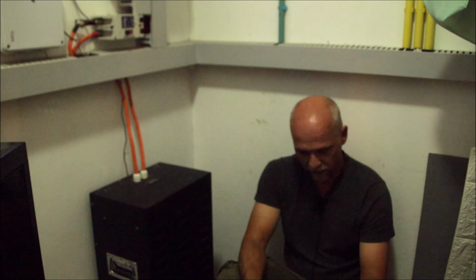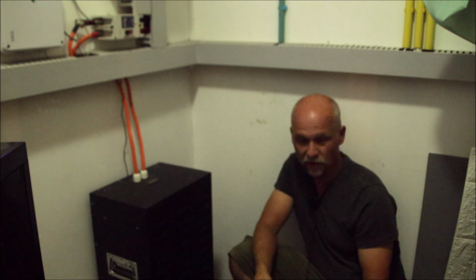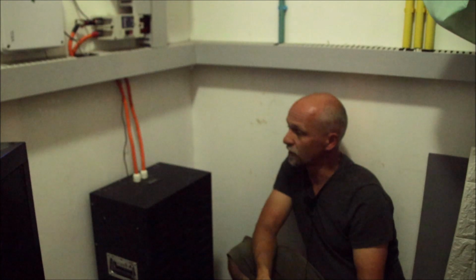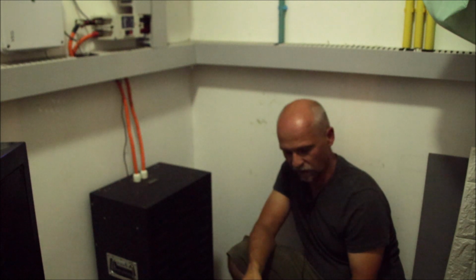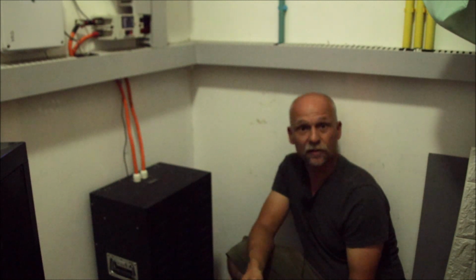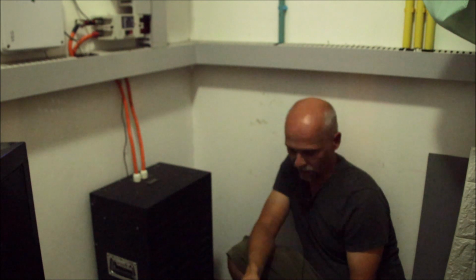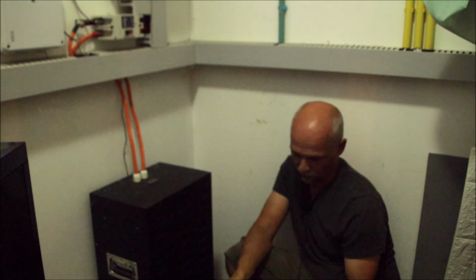Right, this is going automatic, and tomorrow morning we will just read the value on the display, and that's it. How does the normal discharge cycle look? I have a garden lighting connected to this, and at the beginning there's a bit more load on there, because there are some signs and the pool lights, which will then turn off at some point. So for the first 4 hours the load will be around 500 watts constant, and then for the rest of the night it will be around 420 watts. And then in the morning we will just check how it looks.